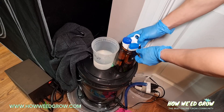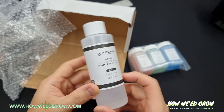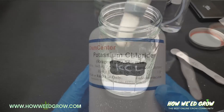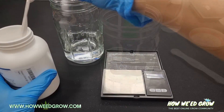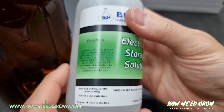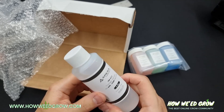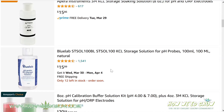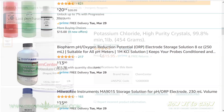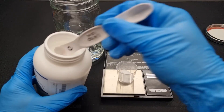To properly store your pH meters, it's best to use a potassium chloride solution, also known as KCL. It's basically salt water that is ion-rich to help keep your probe ionized, and it comes in different concentrations ranging from 1 mole per liter to 4 moles per liter. A list of brands and their recommended concentrations are in the description. KCL solution can be purchased online — an 8-ounce bottle costs around $13. However, the absolute cheapest way is to make your own. For a tutorial on how to make your own KCL solution, check out the link in the top right.